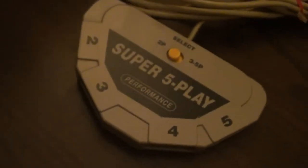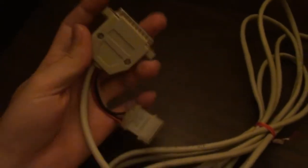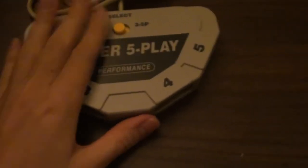I didn't want to cut the ends off Super Nintendo controllers - they're valuable and the wire is not good quality and hard to work with. So the first thing I did was buy four Super Nintendo extension cords, cut one end off and left the female end so you can plug a controller in. Well, that was a big failure - I got one control to work but it wouldn't work well and was hard to solder. A few days later I was brainstorming. I had that Hudson multi-tap, so I took it apart, soldered the wires to the ends of these, and used that. That was my first hack and it worked great - definitely a success in the right direction. Then I made more of these devices and they kept getting better.